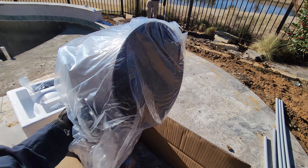So we're going around and digging underneath this stone wall here. We're using ICE 14-4 direct burial speaker cable. Previously this pool was being installed and they had some cheap rock speakers out here — someone had gone right through the wall into the media room on the other side. We've already taken the silicone out and we're going to do it properly, putting conduit from here and going down into the ground. This is 16-gauge cable and we're going to upgrade to 14-gauge, running it through conduit for protection.